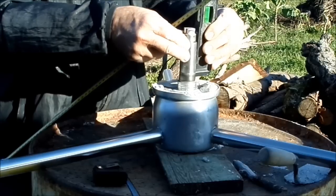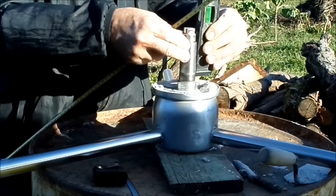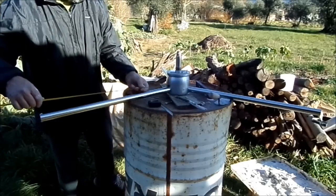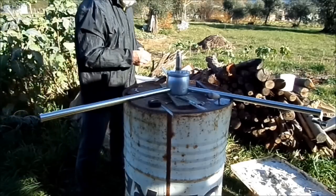After placing the mass, it is necessary and fundamental to adjust the axle, which must remain plumb and square with the body of the hub. The tubes also need to be perfectly straight, and the distance between them must be exactly equal so that the turbine is well balanced.